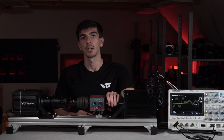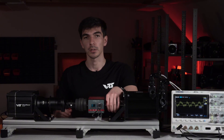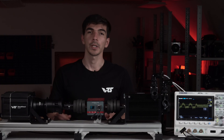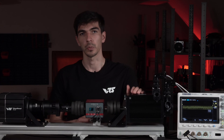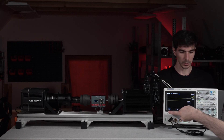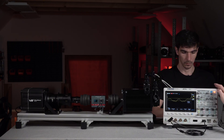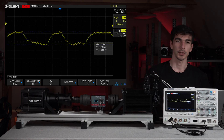If I rotate from the other side, nothing prevents rotation except for the DFP15 friction. And you can see on the oscilloscope that this is slower compared to the industrial servo. Now to make the actual measurement, instead of driving it by hand, I will command the servo drive to make the rotation, and we will make a single capture to avoid capturing noise. Let me enable the servo drive and send the command to rotate. Now let me grab the picture for you so we can put it on the screen.